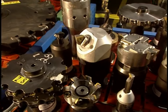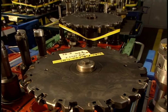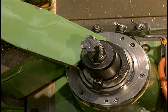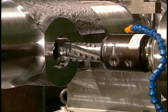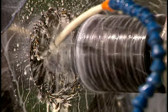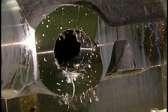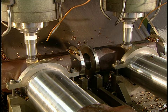We see here the cutting tool used to pierce the holes in the landing gear. To perforate the part, very sharp cutting tools are used. Here they complete an attachment hole. The hole is enlarged on its sides as required by this machine tool. The part is cooled with a mix of water and oil. Cutting is completed and the hole is now cleaned out with compressed air, so that they can proceed with a visual inspection.